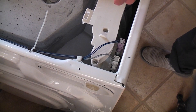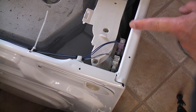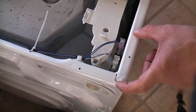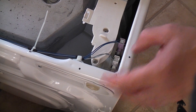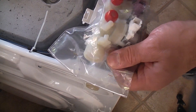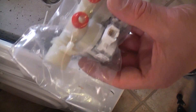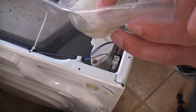I had already taken the top off to ensure I got the correct inlet valve. I searched for the model of this exact washing machine and couldn't find one, so I Googled 'Hotpoint water inlet valve washing machine' and found the correct one — it cost about £10 delivered. As you can see, the replacement is absolutely correct, even with the correct colour-coded connectors. It's always a good idea to check that before taking it out of the bag in case you need to send it back. This one also comes complete with seals and a filter inside.